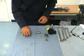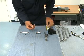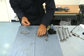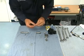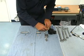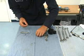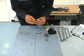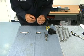We start off by taking our poppet and getting our seals together. We have the small red o-ring — get some Parker Lube on it and put it onto our high pressure seal. Then we'll get a bit of Parker Lube and put it on the shaft of the poppet. If you're in a food grade application, it's important to use food grade lube rather than the Parker Lube. Now we have the red o-ring onto the high pressure seal, and we want the o-ring to be facing this star-shaped piece on the end of our poppet.